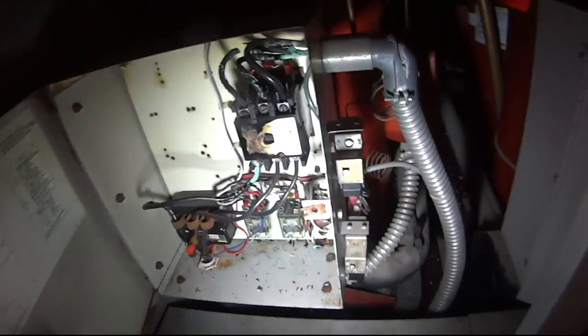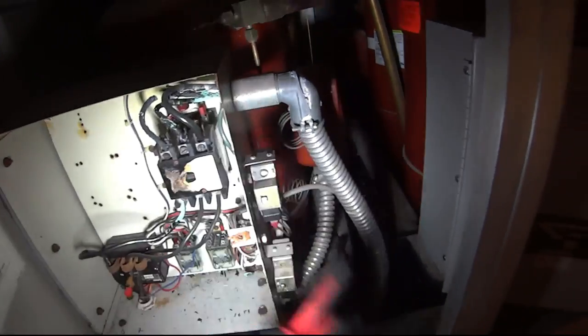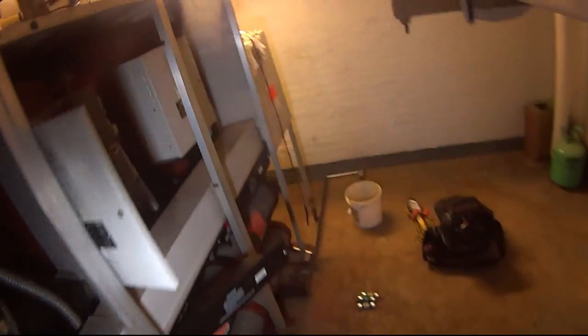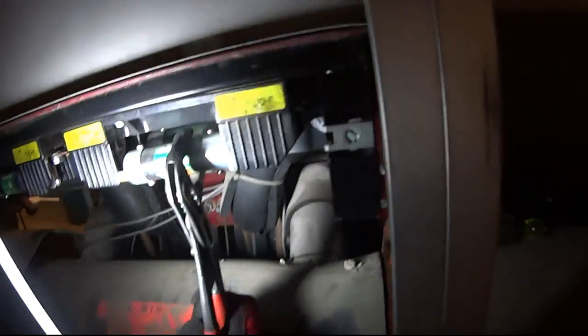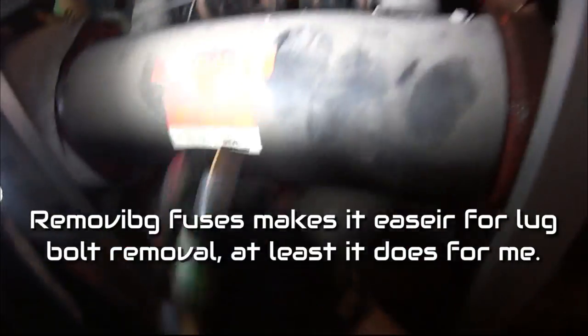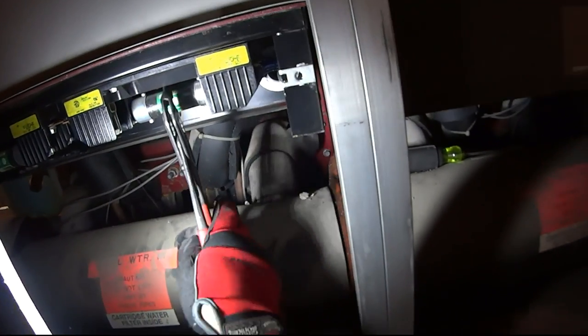And then we have one here cooked pretty much back to the fuse. I'm going to go ahead and pull these fuses out. I shut it off, power's dead. These are, I believe, 70 amp fuses. They're time delayed — they have to be time delayed because initial startup on the compressor draws all that amperage.